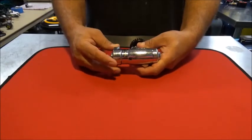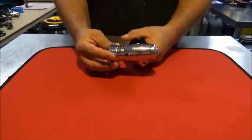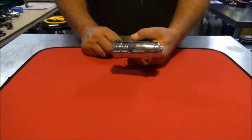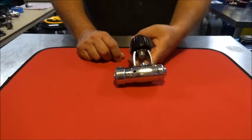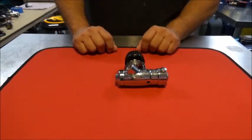It is a swivel, but everything has to come off to the right side, or the left if you wanted your high-pressure hose added up. I've seen these with adapters so you can get your low-pressure attachments off to the left if you like, but it's just kind of not ideal. This regulator would have competed against the Mark V when it came out, and it is a similar design as far as it's a flow-through balance piston regulator.